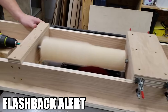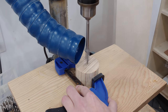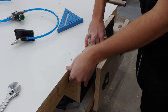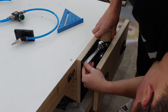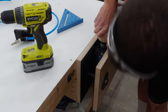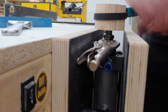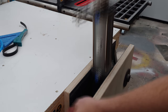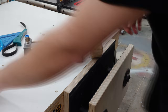I then took a scrap piece of cylindrical plywood left over from my vise build and drilled a hole in the center. The cylinder is held in my linear actuator vise as I screw on the plywood end. Some vise grips were needed to stop the piston from spinning. I used a leather strap wrench to get some better leverage on the plywood, and thankfully the plywood didn't split in half. Once installed, I tightened the jam nut on the back and made sure the piston still moves freely.